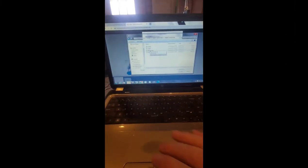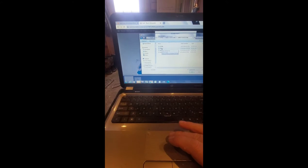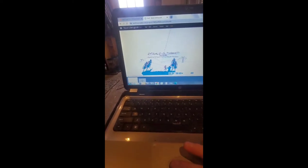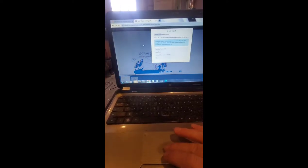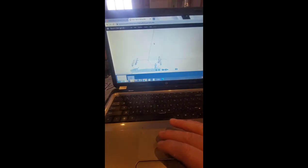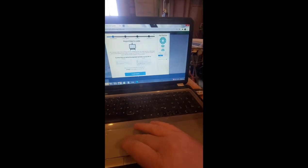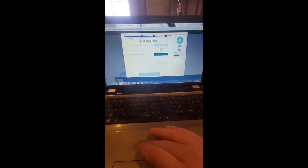Guys, as I was cutting this out with the 60 degree V bit, I was thinking, man, this is gonna take forever. Let me show you all of this right in through here. So I stopped it and I went down to the basement, added a clearing end mill, and I'm only going to use an 1/8 inch end mill. But that should still, there you go. Yeah, that will take out a lot of this. Hopefully get this done a little bit faster. So let's go to carve it. I'm going to get this going and come right back to you.